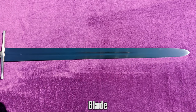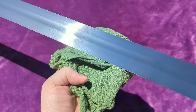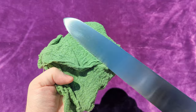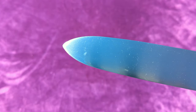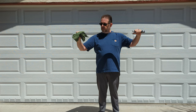And now it's time to talk about the business end: the blade. Here are the measurements I took. I mentioned earlier that there's not a lot of profile taper in type 13 swords, which means they need quite a lot of distal taper to keep from being too forward heavy and handling like an unrefined bar of metal. It's no surprise that the Tritonia features excellent distal taper, starting at 6.2 millimeters thick and rapidly tapering through the first 12 inches down to about 4.5 millimeters, then gradually tapering the rest of the way, eventually ending at about 2.5 millimeters right before the tip.